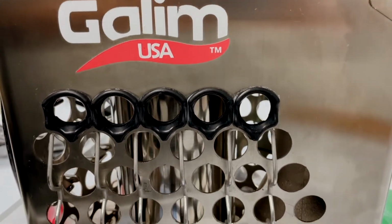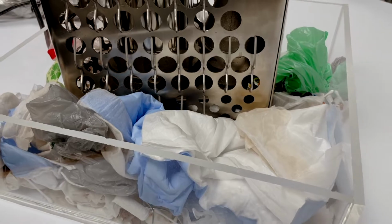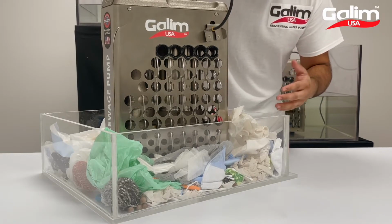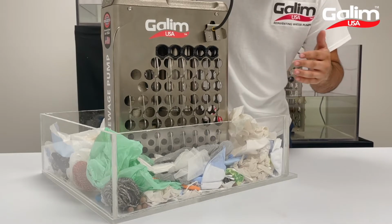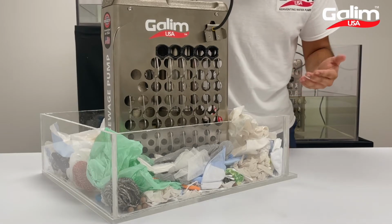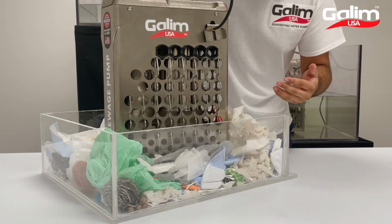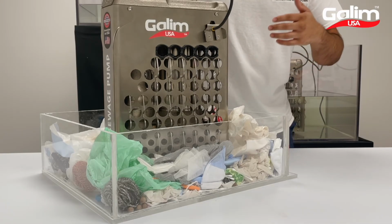So now if you look up close, in the bottom of the protective shell, we have placed even smaller drilling holes. This is for all of those solids that are surrounding the pump, like feminine products, wipes, sponges, toothbrushes, all of that sedimentation in the bottom of the tank, for them not to be able to reach the impeller. We wanted those holes to be smaller so that they can act as a trap for those solids and keep them from reaching the impeller, because once wipes make their way through the impeller, they are going to be entangling screws, wires, even other solids, and once they make their way through the impeller and the pump, your pump is going to malfunction, your pump is not going to be working. So we wanted to avoid that by all means.